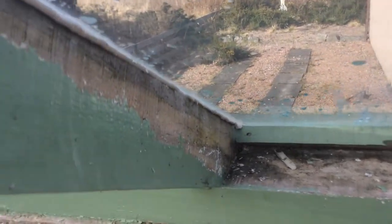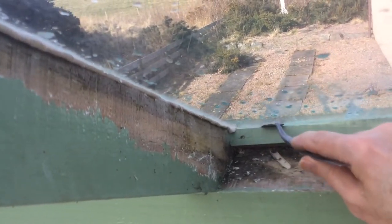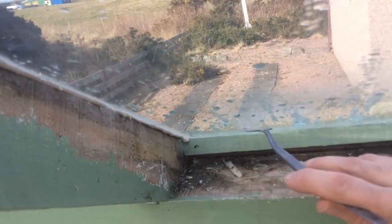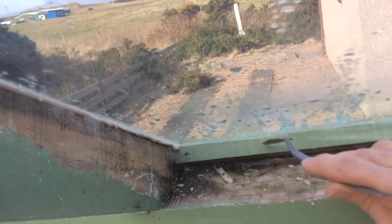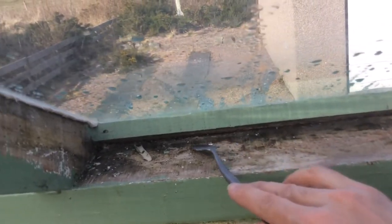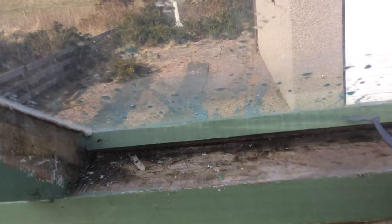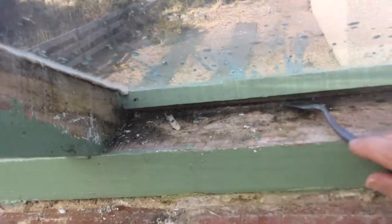So what I've done is, when I've re-glazed this with putty, there's no putty underneath this. It's painted on the outside so that as the moisture runs down here, it's going to run down through this gap. So instead of running off here and collecting on here and making all this damp, it's hopefully going to go down the back of that. I don't know if there's an easier way to do this. There probably is if I thought about it. I had thought of leaving a gap